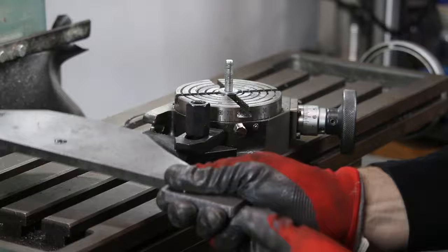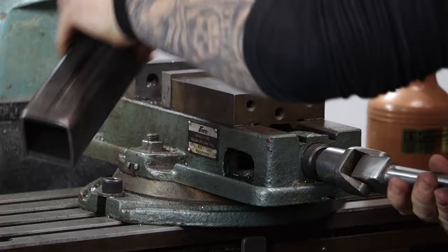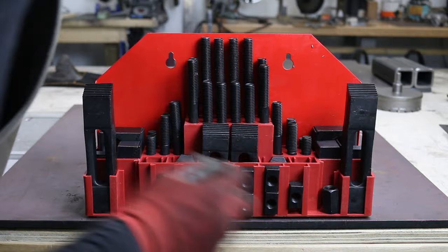The first problem you're going to run into when using a milling and drilling machine is how do you keep your work in one place. I had the device that came with the mill when Scott brought it, but I didn't have what I have now — this little set of threaded rods, nuts, bolts, T-slot holders, and small pieces of steel with holes that you can position to hold down odd-shaped things. For 60 bucks you can buy this kit on Amazon — I'll put a link in the description. Anyone that buys a mill, that is a must-have.